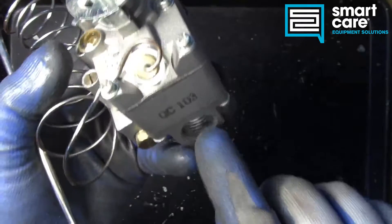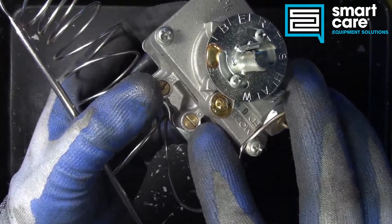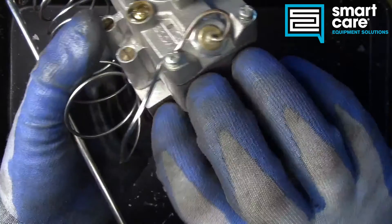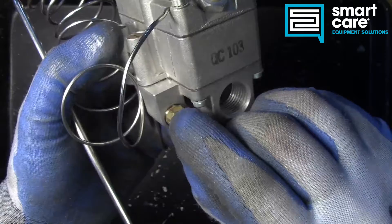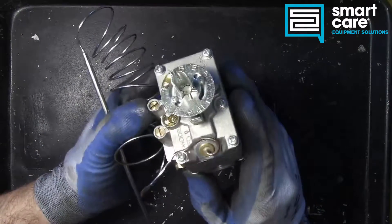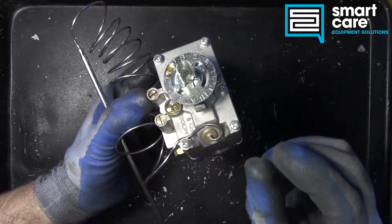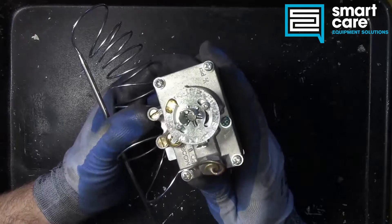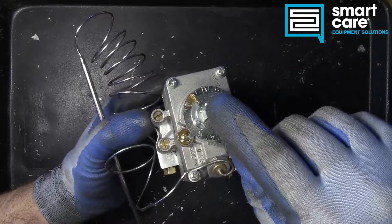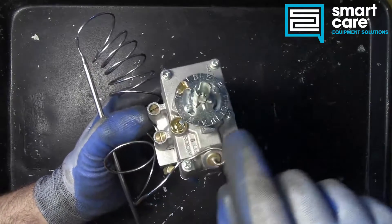When we talk about main gas coming through the outlet, the pilot assembly is controlled through this secondary screw. This screw is acting like a throttle, and the pilot itself would be connected to where this brass fitting is. The bypass port is a function these valves have that keeps the burner lit at just the barest minimum flame possible. You don't want the burner to go completely out every time the thermostat satisfies — you want it to maintain that very, very low bypass flame.